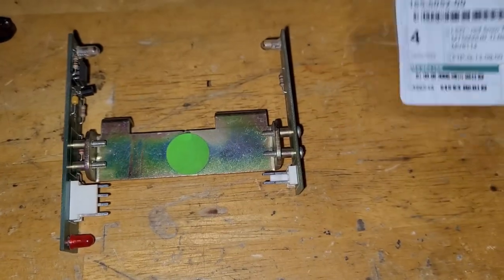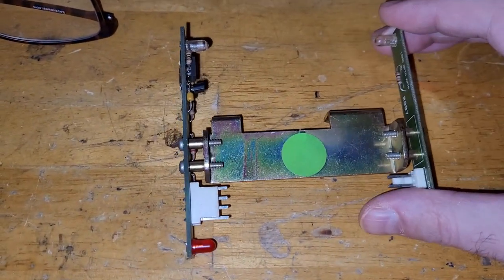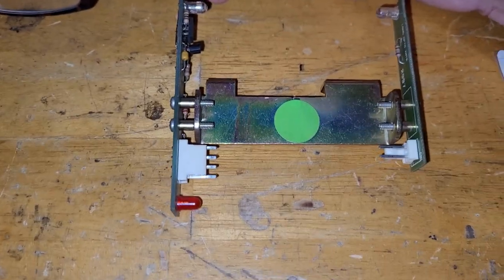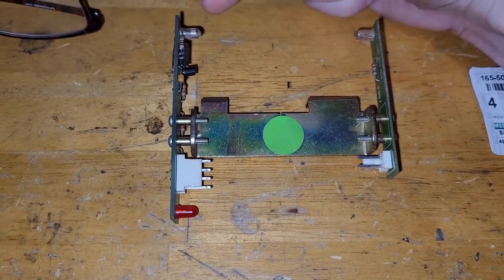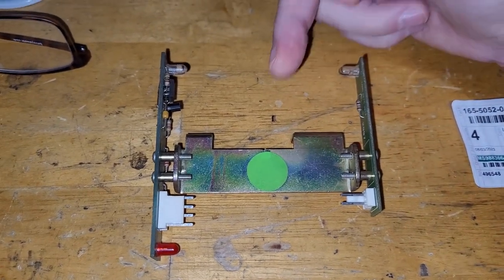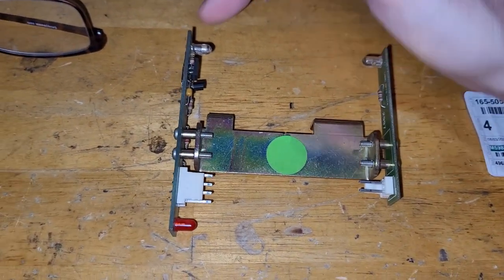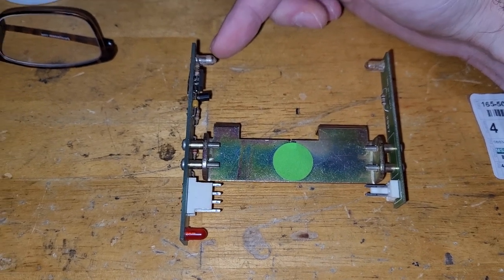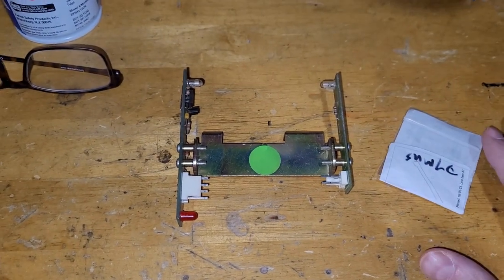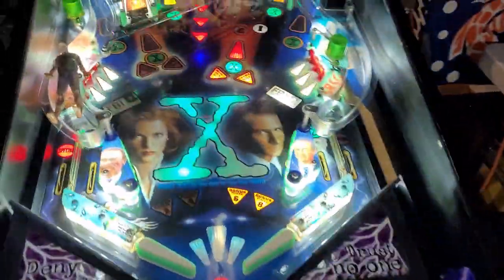I got four just in case. When this is plugged in, I do get one of the LEDs to light up, so the transmitter is working. But it's not registering in switch test, so I am basically blaming the receiver, which I believe is this side. That's my suspicion — I hope I'm correct. I've got the parts to fix it, hopefully.